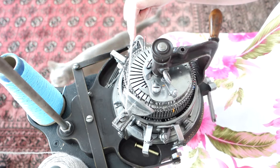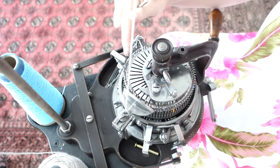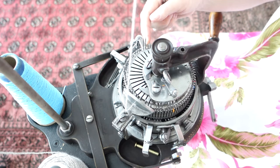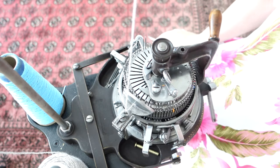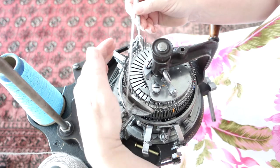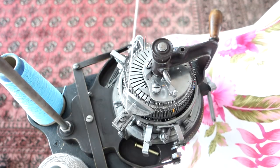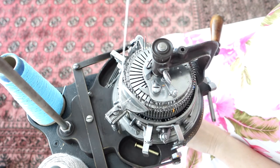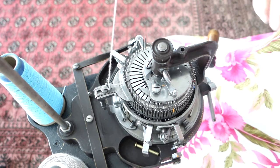will strike this part of the main lever. That will allow the cam to drop down into position where it can then raise the first needle at the right hand side. Now, the semi-automatic machines make a no wrap heel. However, I do like to wrap the first needle and engage my heel spring. Make sure your heel forks are in place, correctly placed. And as I come around cranking backwards, watch what happens now.